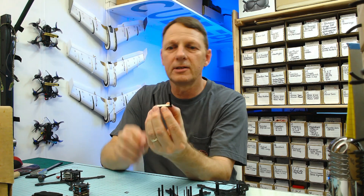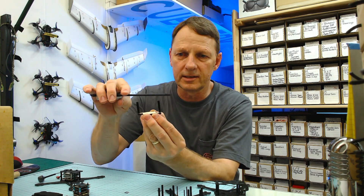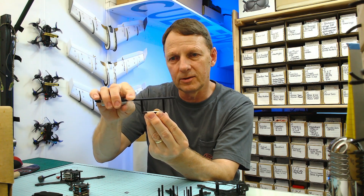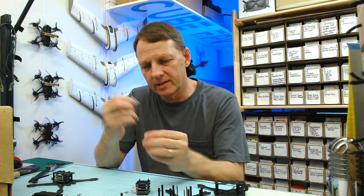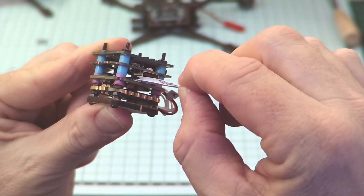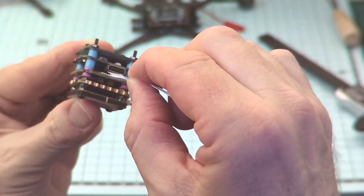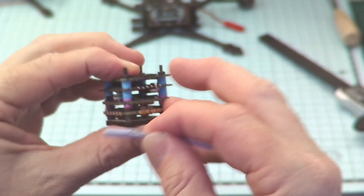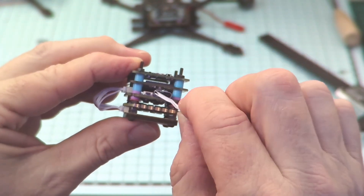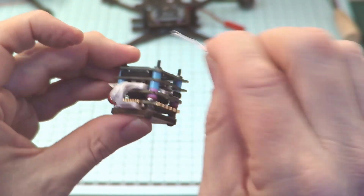Another design option uses two little wings that you can attach the standoffs to. Once you've put those standoffs in, you can check the height of your stack with a ruler and make sure it all fits in the frame. Having the stack accessible like this also allows me to fold up some pieces of paper — I usually fold them until they're about half a millimeter thick — and then just rotate the stack and insert a piece of paper in there to check the tolerances between components and make sure nothing is actually touching. I'd like to have at least half a millimeter between all components on adjacent boards, and at least two millimeters between the ESC and the bottom board.